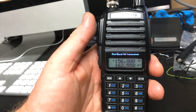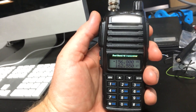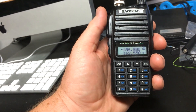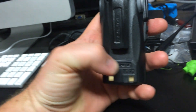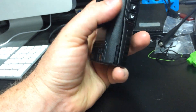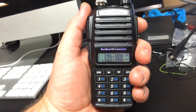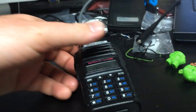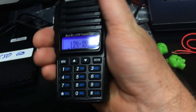I'm going to show you one other thing — speaking of power on two meters. When I hold the radio like this using the antenna that came with it, I get an RF burn in my hand from the battery contacts on the back. This will actually burn me — it feels like a little pin going into my hand right where these contacts are on the battery. So I can't hold this radio normally and transmit that way. I'm not feeling it right now because I'm connected to the coax and dummy load. What I have to do is hold it with my other hand, and then I don't feel it.